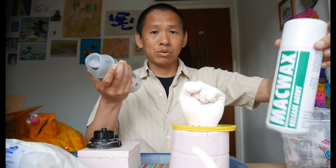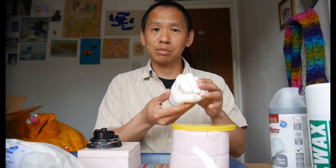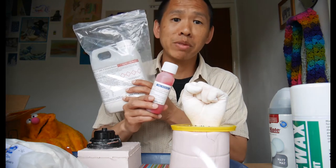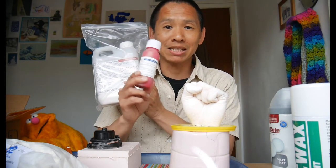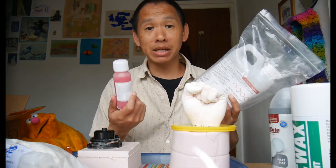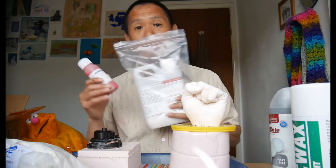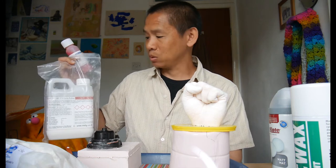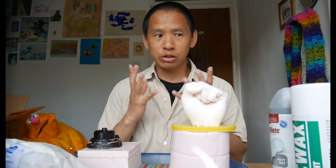The plaster instantly soaked up the sealant and visually it didn't look much different after sealing, but it did feel a little less dusty. I don't know if the release agent was really necessary, but it did release nicely afterwards. Here's my silicone — Polycraft GP-3481F silicone rubber with red catalyst, bought direct from the manufacturers. The working time is 40 to 60 minutes, it cures in 6 to 8 hours, and you can demould in 12 to 24 hours. I got this 1.1kg kit from my mum for Christmas. It gives a lovely easily identifiable shade of pink when properly mixed and it doesn't smell awful either. This silicone requires a 10 to 1 ratio by weight — follow the instructions and use protective gloves.